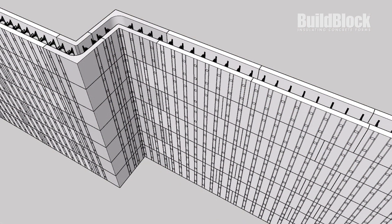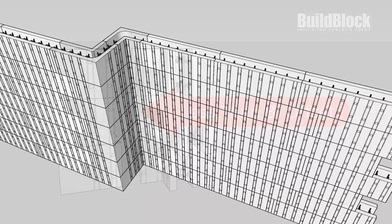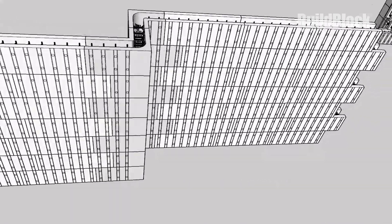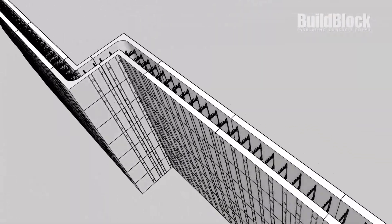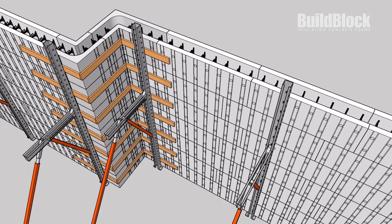We'll start with short corners. The wall is often weakened at this area due to there being a less than 8-inch offset between the courses, making these areas more prone to separating and pushing outward during the pour. Because of this, you may need more than just vertical bracing. As you stack, make note of these spots where the offset is less than 8 inches with a permanent marker, so you can come back later and brace these portions with horizontal strapping before you put on your vertical bracing and alignment system.